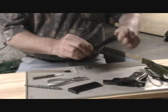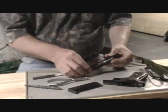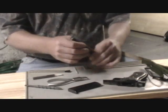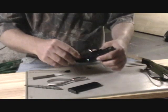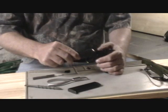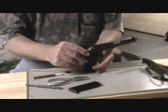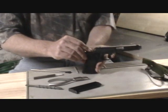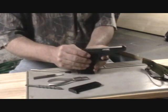Rotate the breech down and make sure it comes in contact with the extractor. Set it all the way back. To assemble the firearm, set the slide on the frame rails. Push straight back until the slide comes in contact with the trigger bar. At this point, depress the grip safety, pull the trigger, press down on the trigger bar, and then continue pulling the slide to the rear.